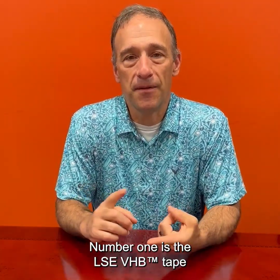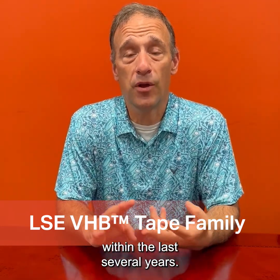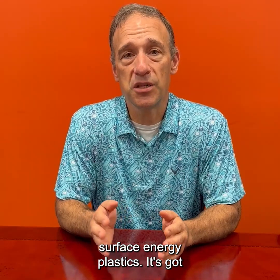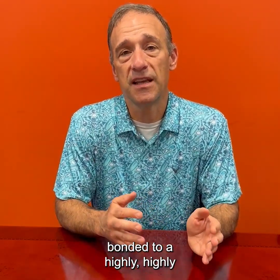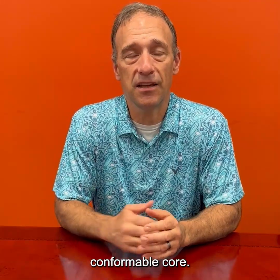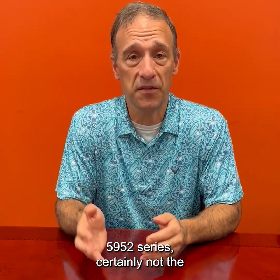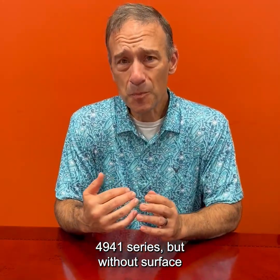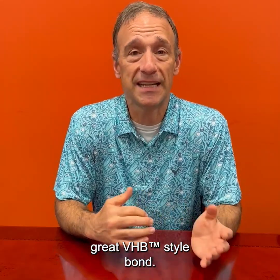Number one is the LSE VHB tape family, which has just come out within the last several years. It's made for bonding low surface energy plastics. It's got a high tack adhesive that's bonded to a highly conformable core. That means the core strength is not going to be as strong as the 5952 series, certainly not the 4941 series. But without surface prep, you can bond to low surface energy plastics and get a great VHB style bond.